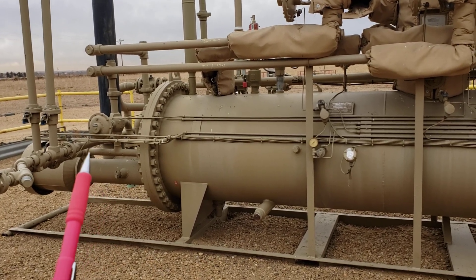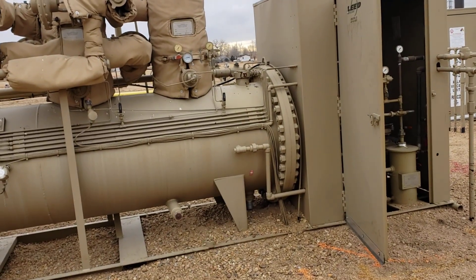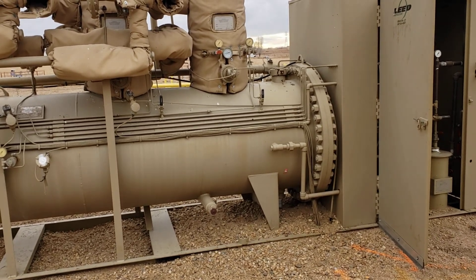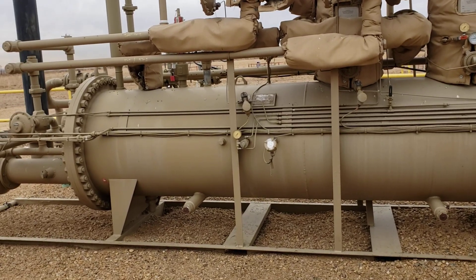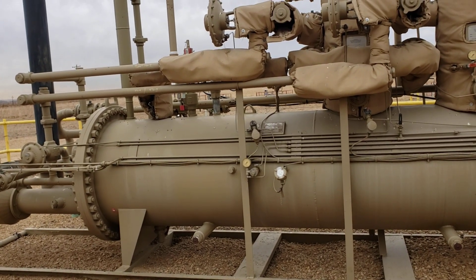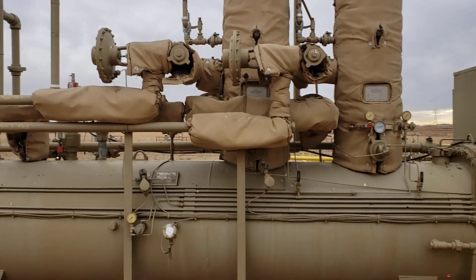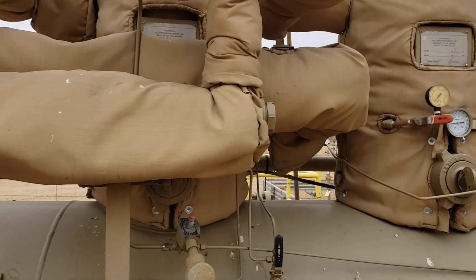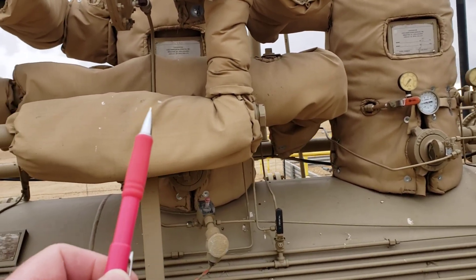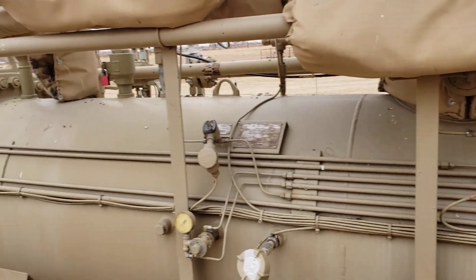It's not uncommon for the fire tube and the weir end or sales end to need to be replaced, so I think the idea was to make it possible to replace components of the vessel assembly with nice and tidy methods. What's interesting, though, is these don't have flanges to remove the gas domes. And when I look at the nameplates, the communicating chambers are rated at 500 psi where the main chamber is only rated for 125 — quite a different configuration.